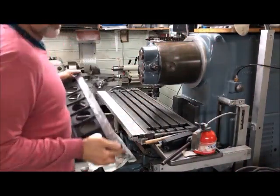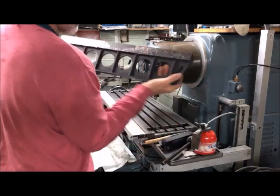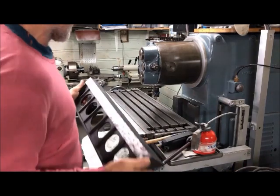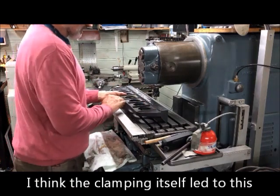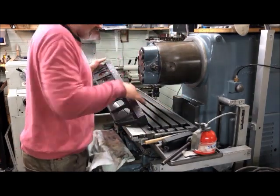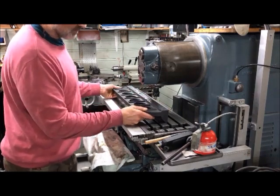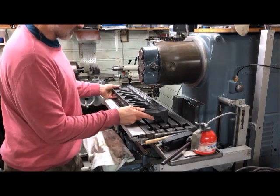I now scraped the rear side also, and as you can see, or probably if you watch closely, I have blue here all over now, but not in the middle here. So that means it was actually bowed a little bit, and I reckon that's because I clamped it down here, and that it's not entirely straight here. So because of uneven clamping pressures, I got it a little bit past. So even though I measured it correctly to be flat easily within 0.01 millimeter all over, when tucked down, it sprung up again on me when released.